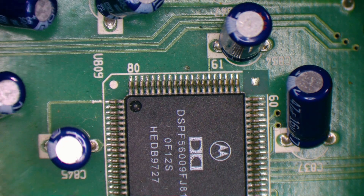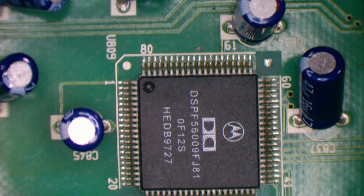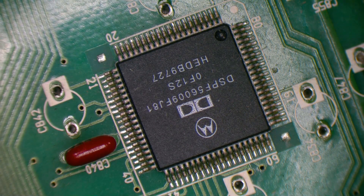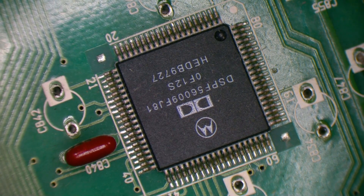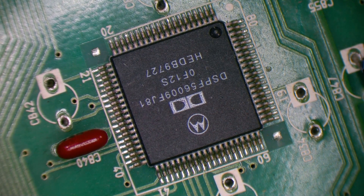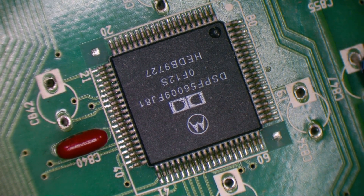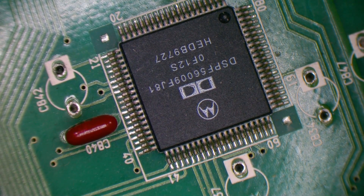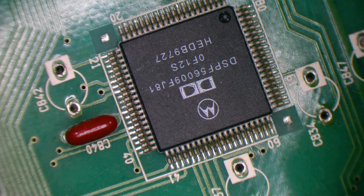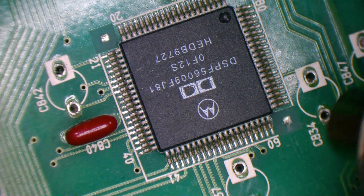I've got one there and one, two, three — so I'll pop them off just to protect them. I think they're all the same value. Then we'll get the chip off, put the new one on and fix that broken trace, see what happens. Now this board is a thick board — it's a multi-layer, or at least a very thick double-sided I think. But there's not a huge amount of ground plane or flood fill, so it's not going to need a lot of heat. I'll start at 340 Celsius.